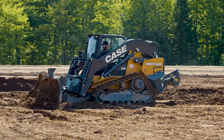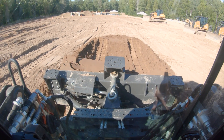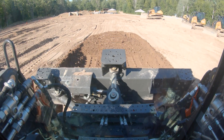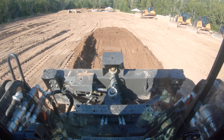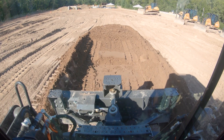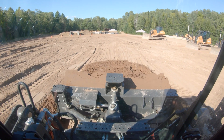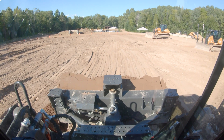It is a difficult machine to grade with because of all of these things. One of the most important things to me in this review was to spend enough seat time to confidently say: yes, you can do finish grades in this machine without machine control. It will take you probably a good three to five days comfortably in this machine before you will be able to finish grade. But you can 100% finish grade in this machine. By about six hours in the cab, I was able to get a good 50-foot long run that was nice and smooth — it looked like I had thrown it down with a dozer. It was work, and a very frustrating six hours to get there. But I can confidently tell you: yes, you can indeed finish grade with this machine.